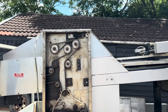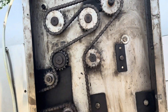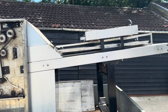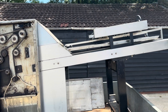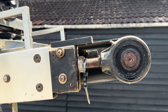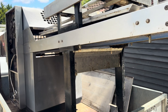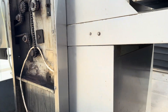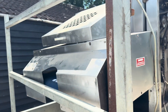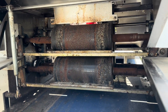As you can see, we've got some micro switches and limit switches that need some attention, and the cabling in general needs attention. It basically needs every bearing changing - a full mechanical refresh. You can see these rod end bearings are pretty old. It also needs a good clean because it's sat unused for a long time due to the problems it's been experiencing.